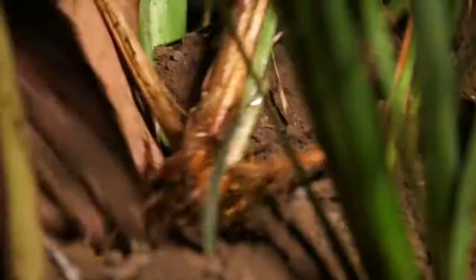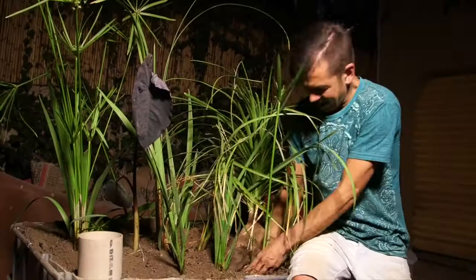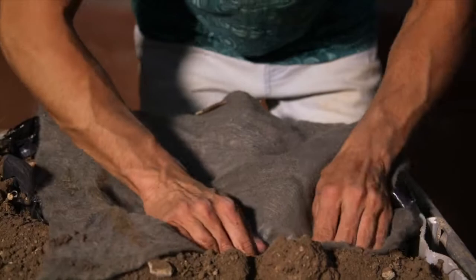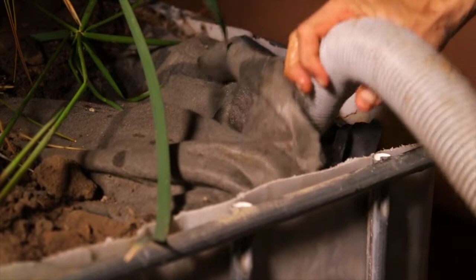All the soaps and the dead skin particles are what causes the water to smell. What the plants do is they use the soaps and the skin particles and all the nasties — they suck them up so the plants thrive whilst making the water super clean so it can be used in your vegetable garden. Coupled with the root activity that helps clean the water, the gravel and all the cavities in between the little stones allow beneficial microorganisms to start living in those cavities and they also bust out all those nasties from the water, keeping it squeaky clean for your further use. Never store grey water in a tank as it will start to smell — always use it day by day. When the water from your bath drops into the bricks it will exit through the 10 centimeter gap at the bottom and then rises all the way to the top, and then we take that water from the bottom of our outlet which creates a longer treatment path and cleaner water.